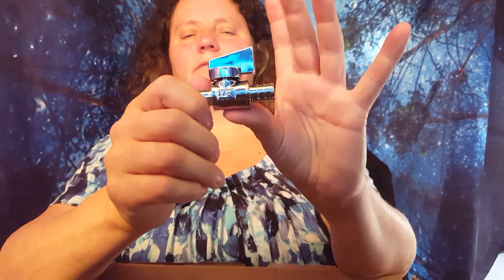For some of the joints I'm going with something similar to a SharkBite — they're called Aqua Lock. Some sources said that SharkBite-type fittings are less likely to leak in an RV because of the vibration. I looked at the price and just couldn't afford to do all of them that way, so we're going to use these in places where it's more likely to flex, and use the standard PEX crimp connectors where the pipe is flat against a board and less likely to flex. They're also very handy where you can't quite get a tool in there easily.